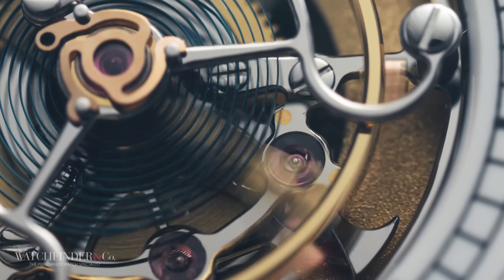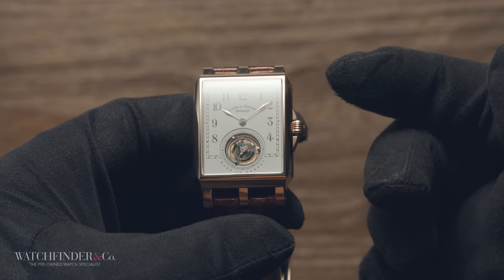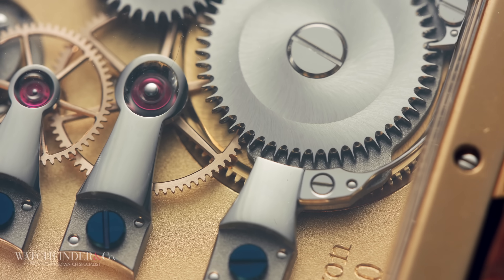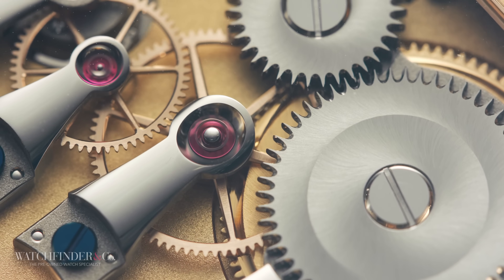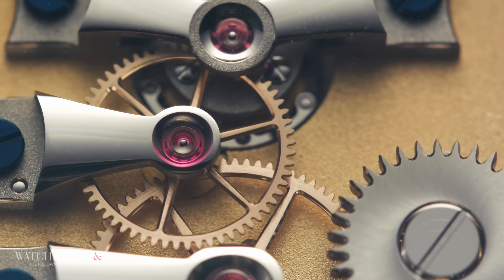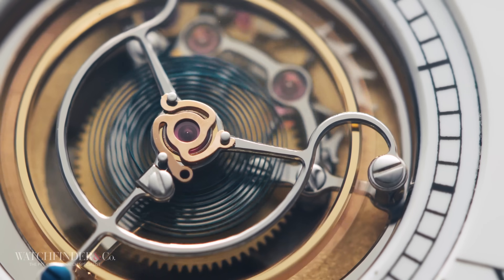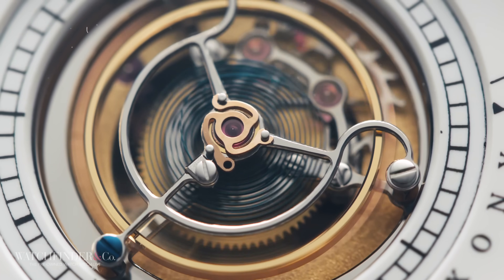That's why technical director Jens Schneider has gone to extreme lengths to make sure the tourbillon in the Lange & Söhne Anton is balanced as close to perfect as possible. The outer cage is thicker on one side and has an opening in the top layer on the thinner side to compensate for the weight of the escape wheel and pallet fork. The gear train, instead of rotating the escape wheel as in a standard movement, rotates the tourbillon cage and everything in it. Below the cage is a static gear which meshes with the escape wheel, so as the escape wheel orbits within the cage it spins as well, allowing the escapement to function normally. This rotation usually happens once a minute, meaning the cage can also double up as a convenient second hand.